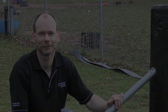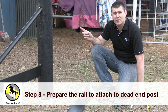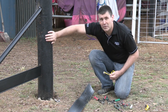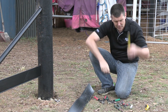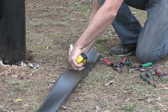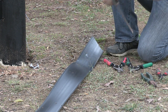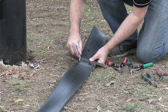Thank you for watching. Today, we're going to prepare the rail to attach to the post. First, with our tape measure, remembering we've got a 200mm post and we want 150mm extra. So we take our tape measure, our marking pen, and we're going to measure 350mm. Grab our square, mark off.